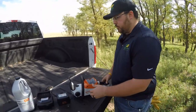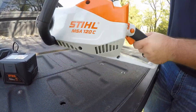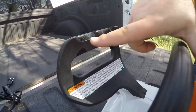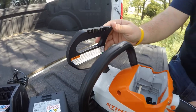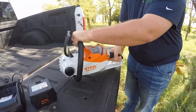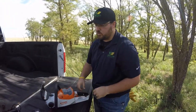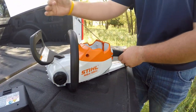Now we're going to take a further look into the saw itself. It is a plastic unit, but everything is pretty solid — as I sit here and try to torque and twist on it and hit it on the tailgate, it is solid. Next is your chain brake. You have an unlock position, which is back — pulling it back unlocks and lets you run the chainsaw. It has a forward position to lock the chain out as a safety feature. So as you're running the saw, if it were to catch and throw back at you, your hand would hit this and lock the chain out to keep you safe. It also has the oil chamber, which is very important to keep everything lubricated.